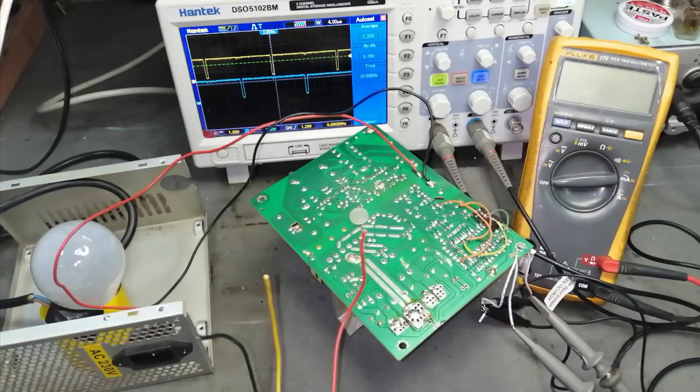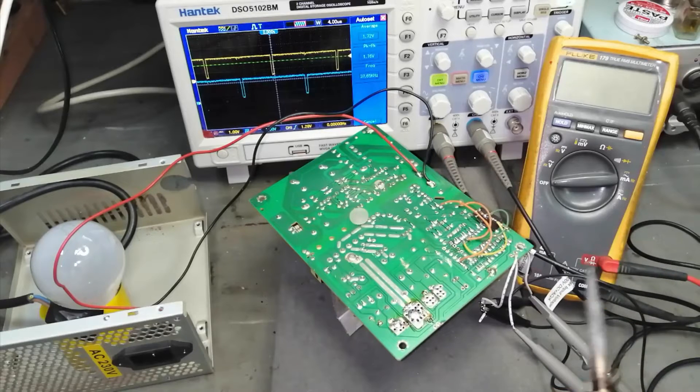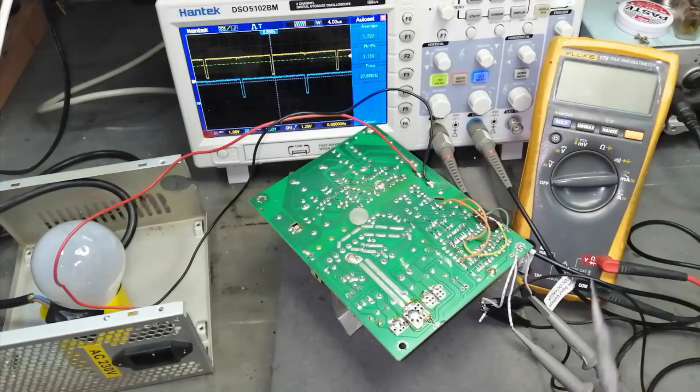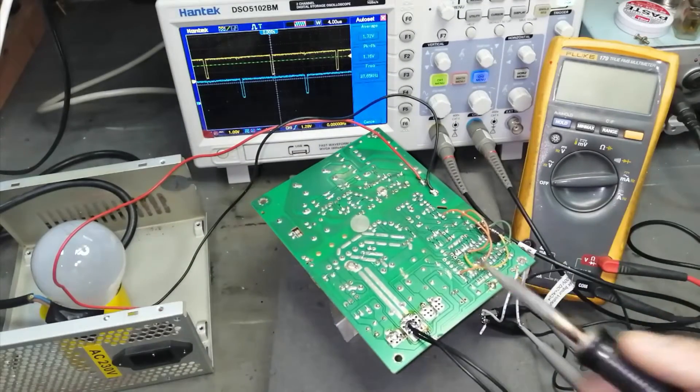This is SDC 2921. In my last video I removed the sense circuit, the feedback circuit, proceeding to pin number one, two, three, and I made a simulation using three resistors. If you did not watch that video, before watching this one you must check it. Today we will go in detail — this video is bound with that video. I will share the link. The purpose of this video is to adjust the voltage as we require.